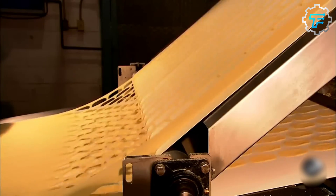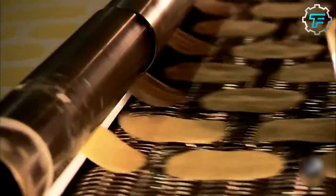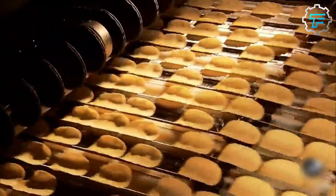For the already cut pieces, they travel on another steel conveyor into the fryer, where they are fried at a high temperature. At the fryer, there are giant curved molds, which roll on the cut pieces as soon as they enter the fryer. The pressure from this mold creates the inward depression that makes the chips stackable. The chips pass through the hot oil for just 11 seconds, and they come out very crispy, but at this point they are still bare and unflavored.